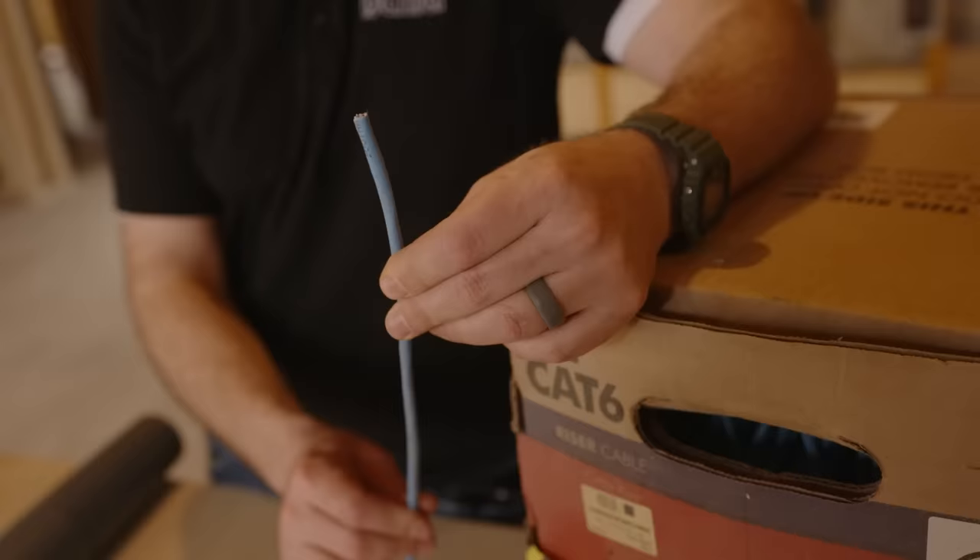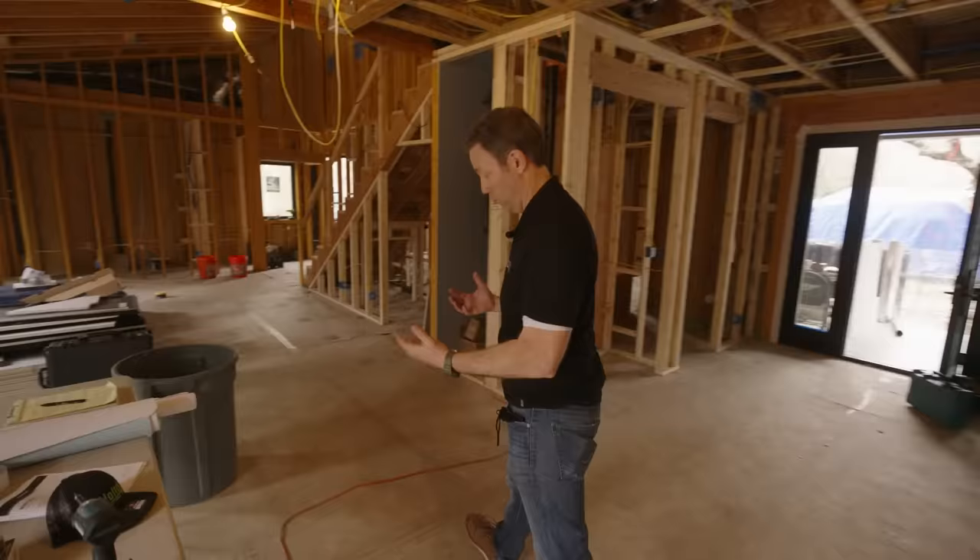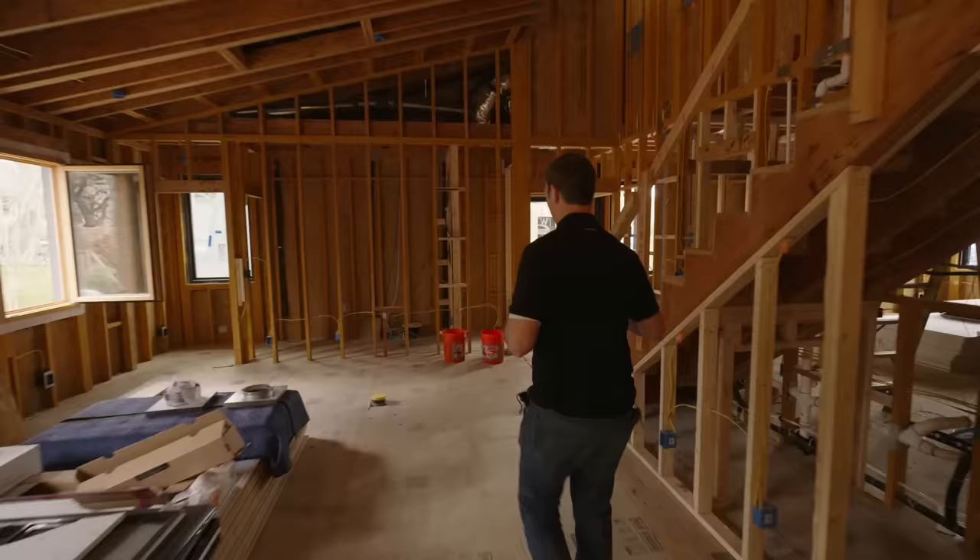When I say low voltage, most of you are thinking two types of wires: some kind of Ethernet wiring — which in the past has been maybe Cat5, I'm doing Cat6 at my house — and then coax. Usually you're thinking about some location in the house where there's a low voltage panel box, kind of like your circuit breaker box where all your electrical wires go, but for low voltage.